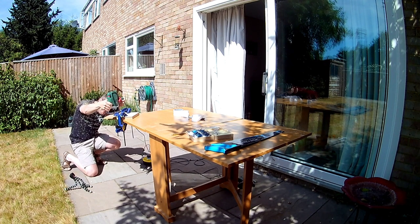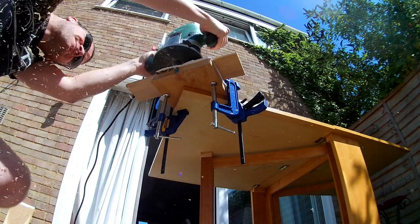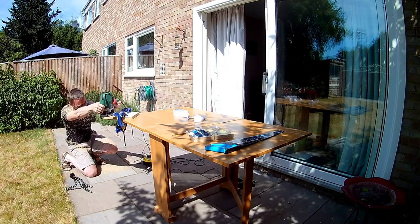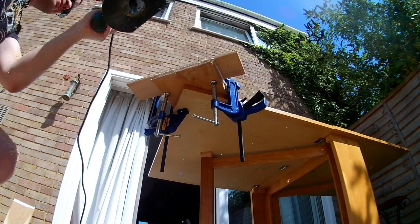To use this, I clamp the straight edge to the wood with G-clamps, which are much stronger than my quick-release clamps, and then use the easy clamps to hold the workpiece at the table. I can then run the router along the edge of the workpiece, and completely cover myself in wood shavings. Lovely. Once one side is done, I can then repeat the procedure with the other three.